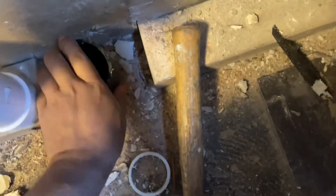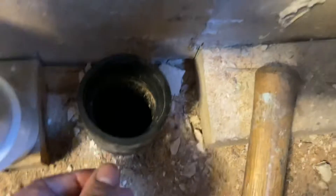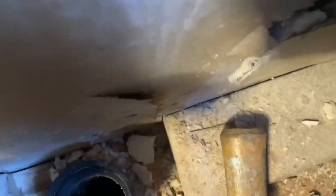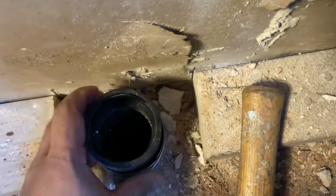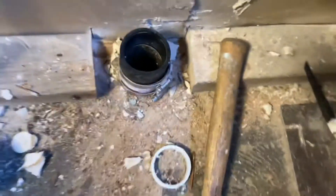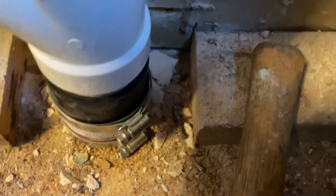That's because I'm transferring from copper piping to PVC. Once you have this end, you could either put a PVC or go from copper to cast iron — copper to any other type. But this copper, as you can see, is thin. Even though it's two inches, it's thin, so it requires extra rubber.